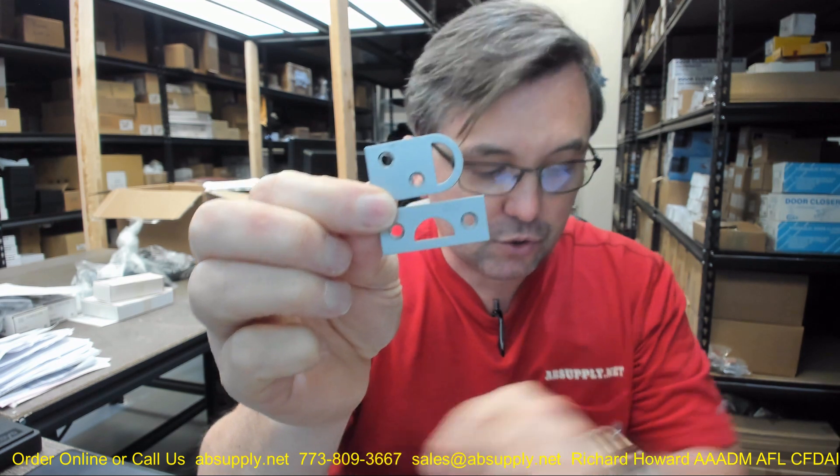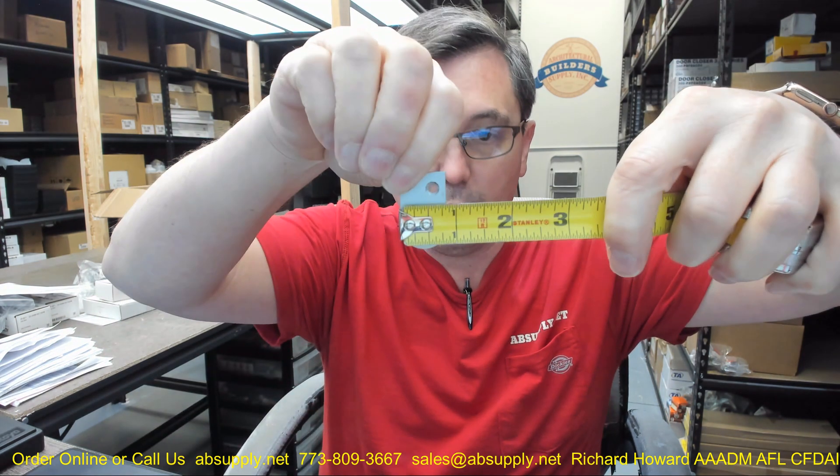If you're putting this onto a double door, you'd probably just put the rim strike down into the edge of the other door and be able to lock it securely that way. The rim strike is called rim because the hardware is installed around the perimeter or rim of the door. The mortise strike — you're not going to mortise this per se because that material thickness is maybe 20 to 30 thousandths of an inch, so you'll probably just surface mount it. Your rim strike has an overall length of about an inch and three eighths with an overall width of about 13 sixteenths. Your mortise strike has an overall width of about an inch and five eighths and a length of about an inch and five eighths, with a width of about five eighths of an inch.